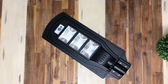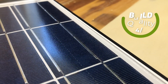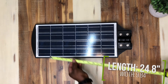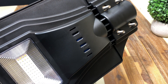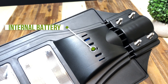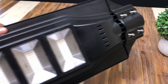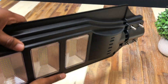I will perform a detection test later on in the video. The detection device by the green power-on button has a 360-degree detection angle, and depending on the height you mount the light, it can detect humans or animals 26 feet away. The overall build quality for the unit seems to be pretty solid. I like how the solar panel is integrated with the unit, unlike some where the solar panel would be an external device, making the entire setup more cumbersome. As for the dimensions, the light is almost 25 inches long and shy of 10 inches wide. One concern I did have while handling the solar light is the battery inside does not appear to be fastened or strapped down. Considering the light will be in a stable mounted position, this shouldn't be a big deal, but it would have been nice if they secured the battery a little bit better.